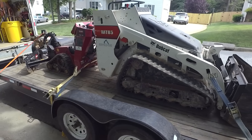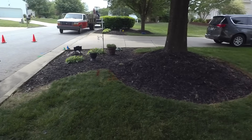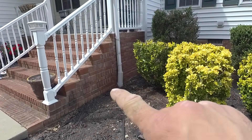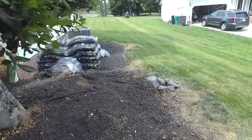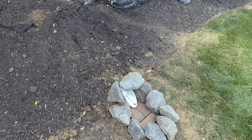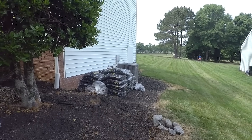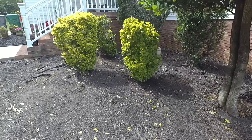We're just getting loaded up over here. I wanted to show you the other side before we got too far. We caught these two gutters here and just took it right down to here. So there's our outfall — the homeowner wanted us to put some rip rap around there to try to protect it. That should be good. This neighbor was fine with this discharging here — it's far enough away from the house. We didn't want to discharge behind because it was aiming right at the house. So I'd say we're in pretty good shape, ready for rain.